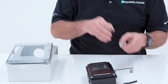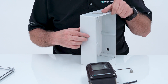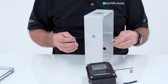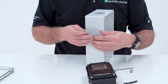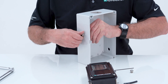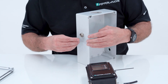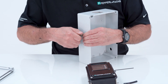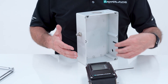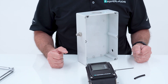For your bulkhead fitting — your reference pressure port — you need a hole slightly bigger than 9/16 inch because this is a 9/16-18 thread. That goes right through the enclosure and you screw it on to provide a seal. Then I would take the second sintered element and screw that onto the port to keep dirt and dust out. From there you connect your tubing back in, and that gives you reference pressure and enclosure pressure.